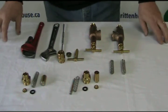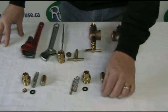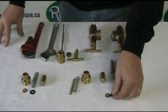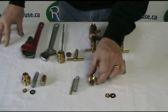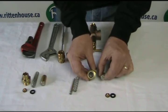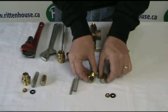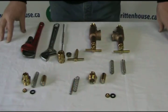The other parts of this regulator are the top seat, push-down for the spring, upper seal, and the main seat at the bottom. Note on the seats the silver color — stainless steel — which makes them last longer than others. There are ones out there with straight brass; they don't last as long as these.